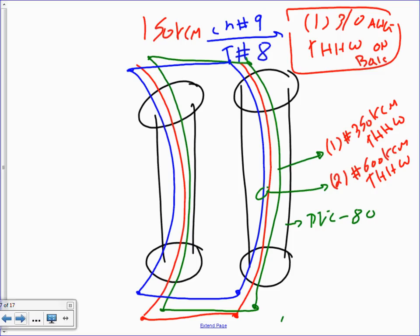And I'm intentionally trying to be boring here and do the graphic because I wanted to stick in your mind what paralleling is. That's how we do it. They're tied. Can you see it? They're two different conduits, but they're tied together at the end. How they tie in: they land them under a two-lug terminal, a lug that has one terminal, two terminal. They take one hot from here, one hot from here, and tie them under a two-lug terminal. Does that make sense, what paralleling means?